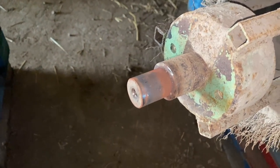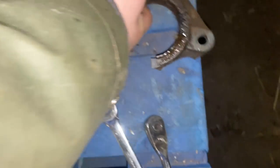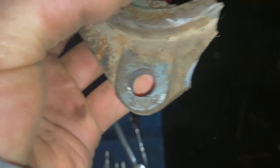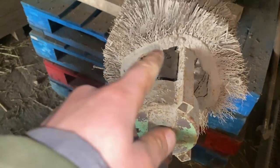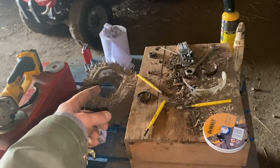Right, we're down to just the shaft, so I can get a new bearing sorted out. The collar's down there — it's still really hot. There's the outside of the bearing that we battered to pieces to get off, because we'd already snapped a corner bolt mount off anyway. So I'll take those two in and get a new one sorted out, and then brushes — I've got a few of them off so I can get the diameter and get some ordered.